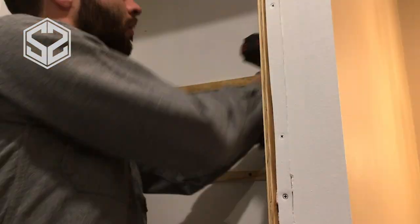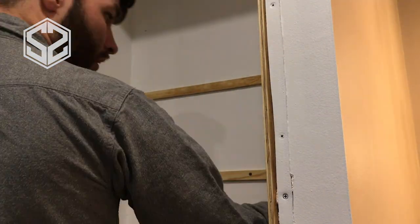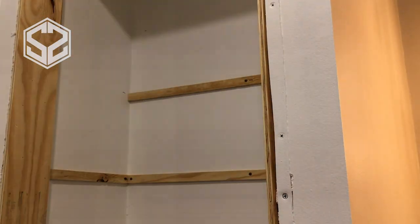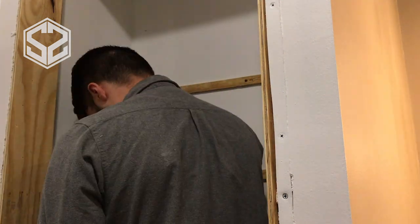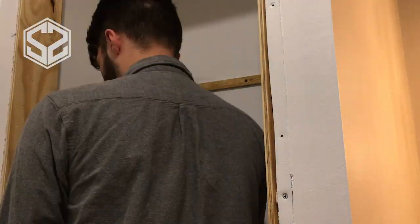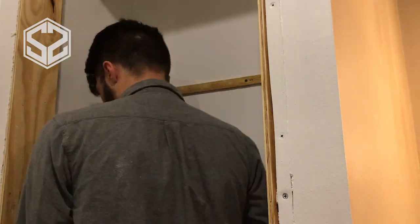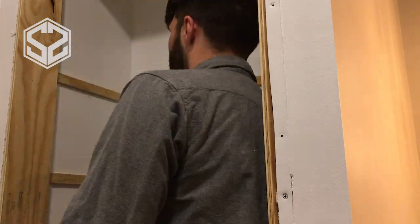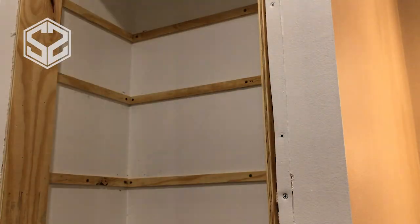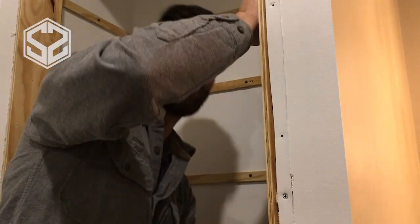Now for the shelves, I'm going to be building these from scratch. I'll cut a thin strip of plywood to use as the brace for the shelves to rest on top of. I'm installing these in now, putting a few screws into the studs so my shelf will have something to rest on. I'll be cutting the shelves out of three-quarter inch plywood, which has a lot of strength — I'm not really worried about bowing. I'm also going to put a piece of wood across the face of the shelf, which gives extra strength to keep it from bowing under long-term stress.